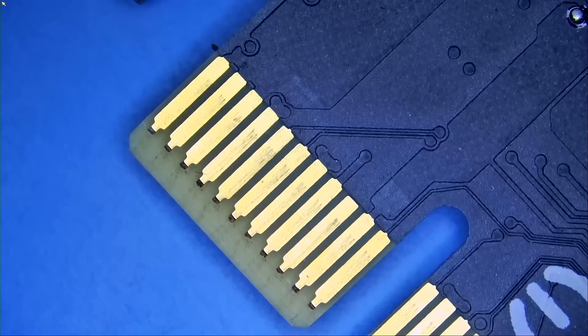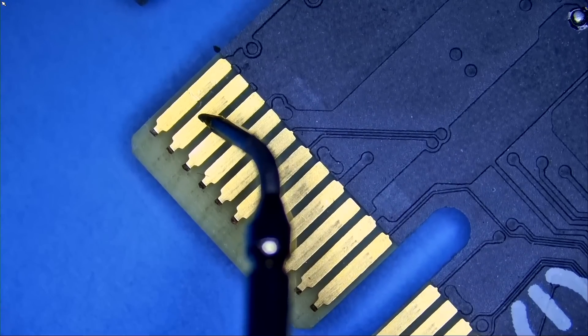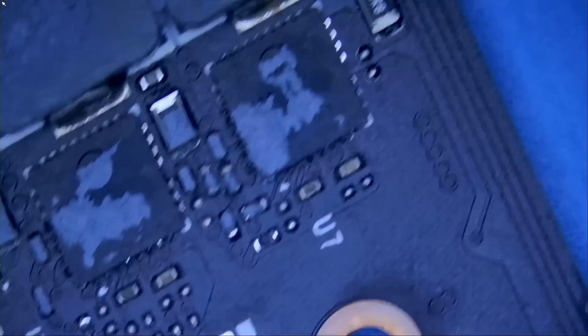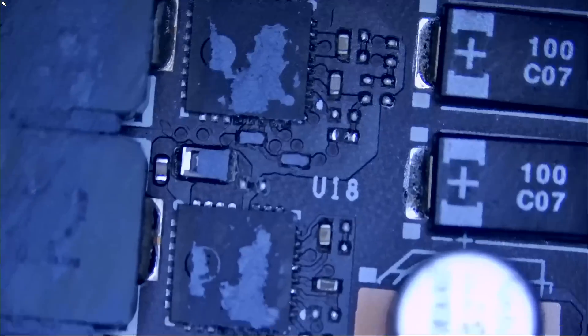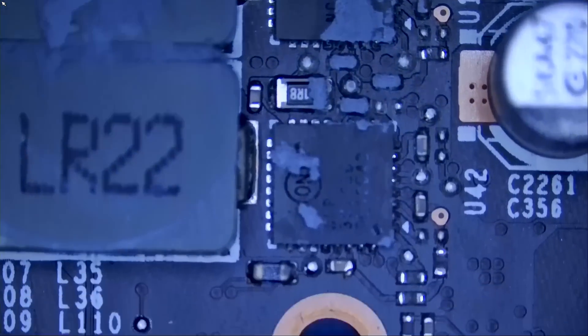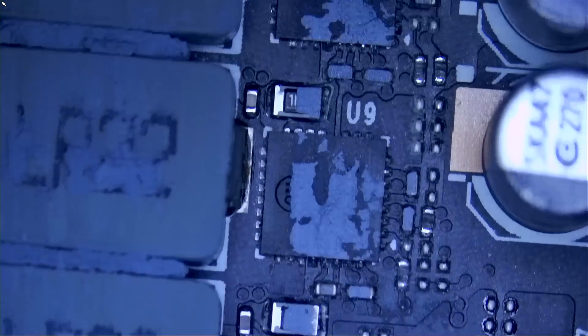Let's quickly measure down here — I just want to see if we have a 12-volt short on the slot. And we do not. So let's focus on which one of those MOSFETs is faulty. If we just look at them — visual inspection — they all look the same. None of them look faulty. We do not see any burn marks, any exploded chip, or any discoloration. Nothing. So which one is faulty?